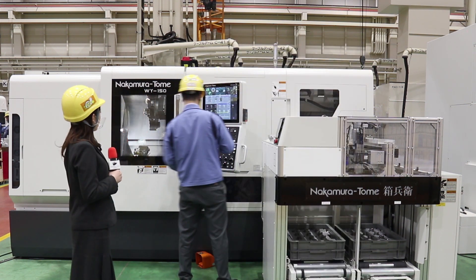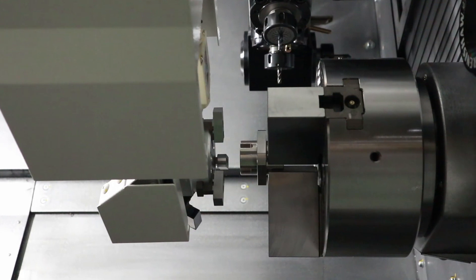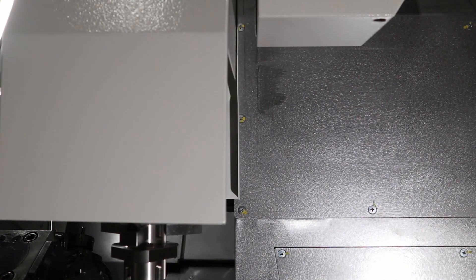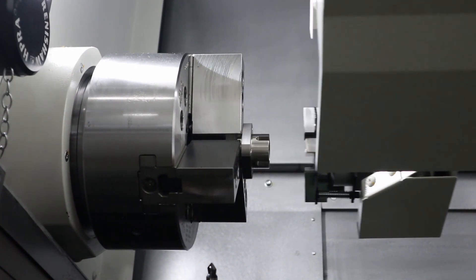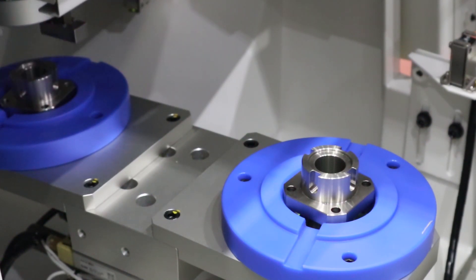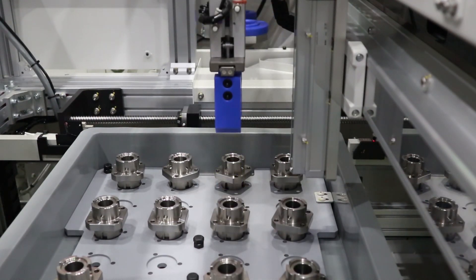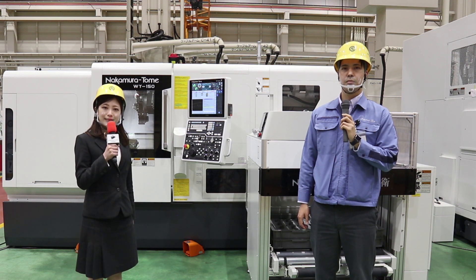I'd like to see the movement of this system. Let's push the start button. The arm is coming from the right side. It's a double hand — another hand is actually hidden behind the cover. This hand has already held the material. The compact loader is checking the finished product and moving away. Then the right spindle picks up the workpiece machined by the left spindle and transfers it. The material is loaded, and the finished products are brought to the reverse station. After turning around, the robot on the stocker picks up the workpiece and puts it on the pallet, then places new material on the reverse station.